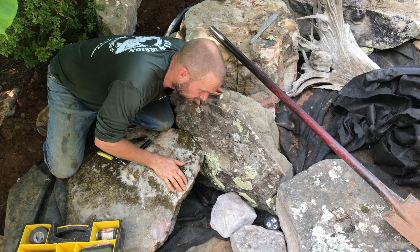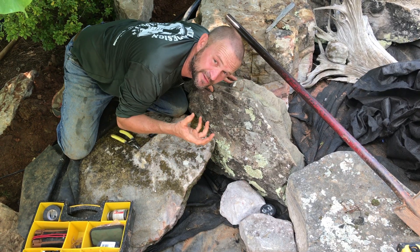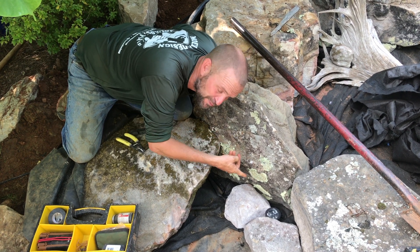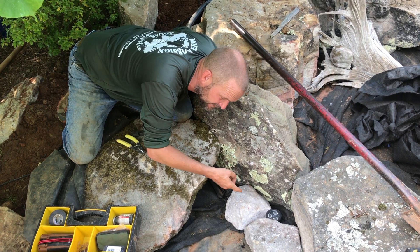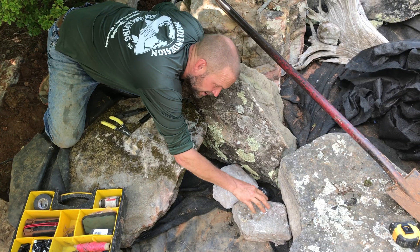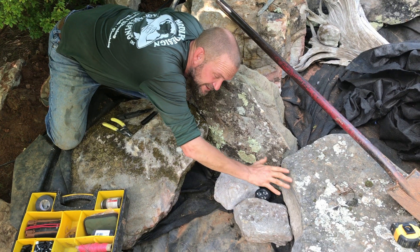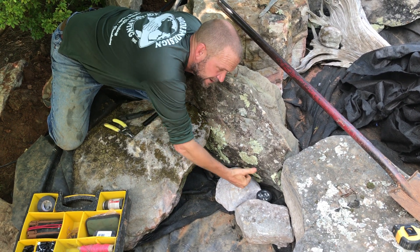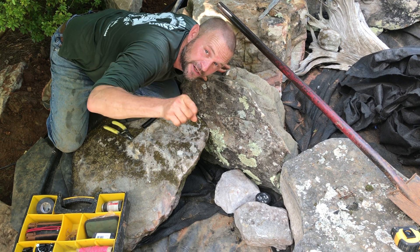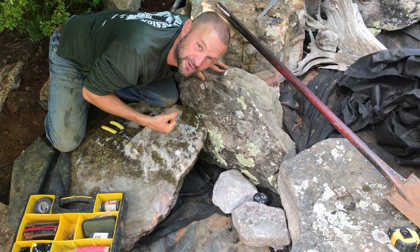Here's another thing — when situating your light, Aquascape gives you little plastic stands that come with the lights. I say that's amateur homeowner stuff. Don't use those stands — your lights will fall off. Instead, situate the light properly under your waterfall where the water will sheet over it. Put rocks in front of it to block the headlamp effect from the viewing area. A light shining straight up through white water gives you that magical fire-light effect — don't forget to create some magical fire light.